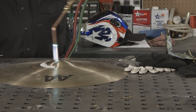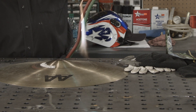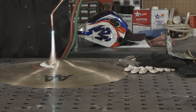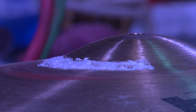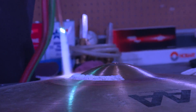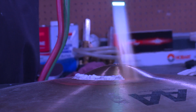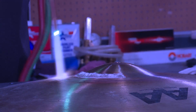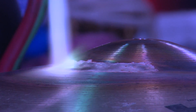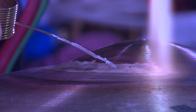This will take just a few minutes, but what you'll see is this flux will start bubbling and eventually it'll go clear — it'll look like a clear Karo syrup. I'm taking my time on this, not creating any major hot spots. I'm going to start getting a little more isolated. You can see some of the heat changes taking place. I just don't want to stay in one spot too long. It's starting to get clear — I can see a little bit of contaminants, some of that black showing up. I'm testing it to see if it's hot enough — not yet, getting close.